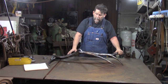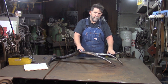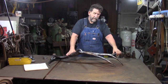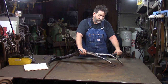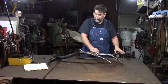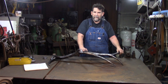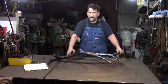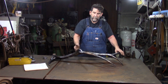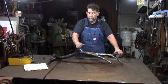The first thing we do is we take the main beam and we rough bend it. Okay? As you'll see in the video, I put it in a pipe vise and I heat it up with a rosebud and I bend this and this. Now when it comes to this bend here, I find it's easier once I establish where it needs to be to heat it up in the forge and just use the weight from here down to bend that. I just face it the way it needs to go when I bring it down on the anvil and I bend it. Okay? So I do it both on the bench with the rosebud and I do it in the forge using the weight